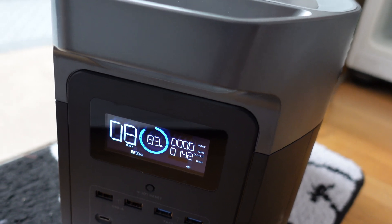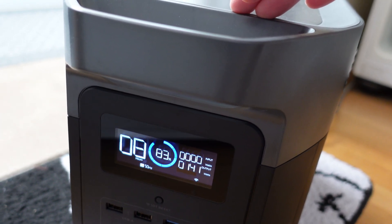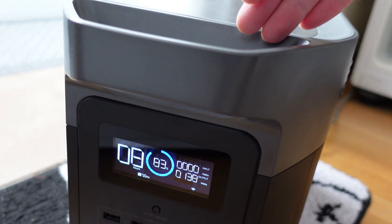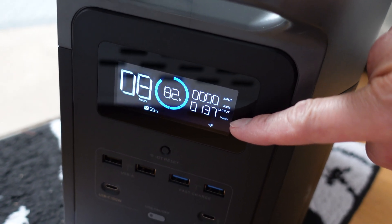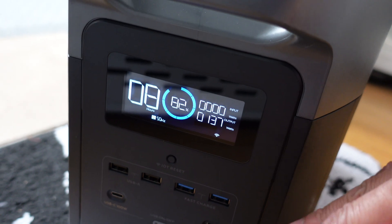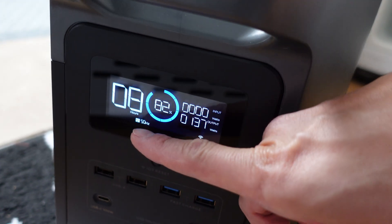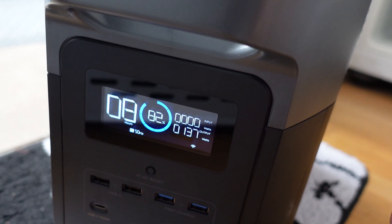The next most important use for this battery is providing backup for the house. Speaking from experience during a blackout, what you really want is your fridge to keep running so cold items can be stored safely. At the moment it is connected to my fridge — it's only running at 137 watts, so not much electricity at all. The fridge powers on and off during its usage; when it reaches the desired temperature it shuts off. Even so, at this rate you've got eight hours of battery life at 82% state of charge, which is pretty good — hopefully your power will be restored by then.